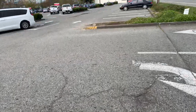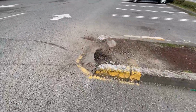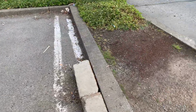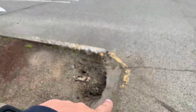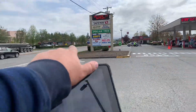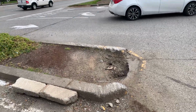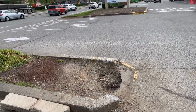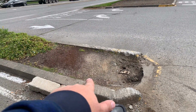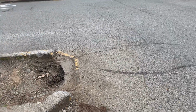Over here in this area, got curb to be replaced. Right on the top, this had rebar in it. So it was poured on top, but it had rebar inside of it. So we can do 2 sticks of horizontal rebar on that. We've got an 8-foot section here. Saw cut it right here at the joint, go over to the other joint. Remove and replace that.